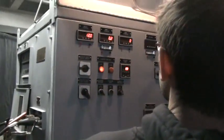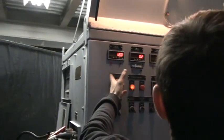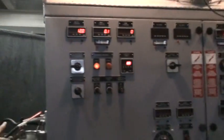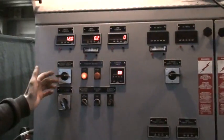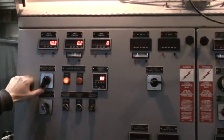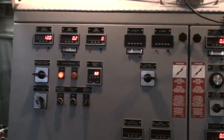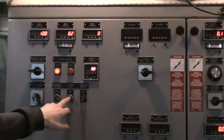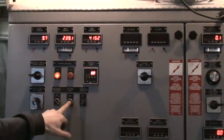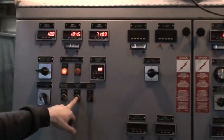Here on the starter side it's a little simpler. You have a coarse and fine voltage adjust. This particular starter is a 12 volt starter, so you select 12 volts here. To get exactly 12 volts, you move these selector switches — and we've got 12 volts there. To test, you just press this button. That's drawing 180 amps and running at 7,000 RPM.